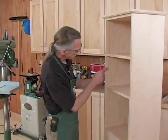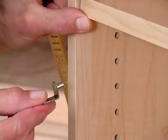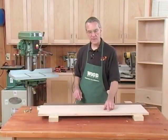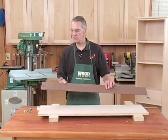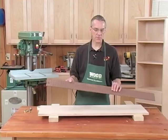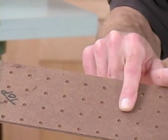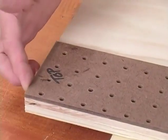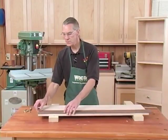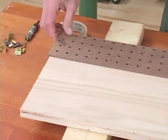So here, we're going to drill a row of evenly spaced holes and use shelf rests. How do we drill a row of evenly spaced holes a uniform distance from the edge of the workpiece? Probably the simplest method is to use a strip of perforated hardboard — quarter inch holes, one inch on center. Place it on your workpiece. I've marked the top of the guide because you always want to index your guide from either the top or the bottom. I've chosen the top, so that as you do all case sides, you don't risk misaligning the holes.